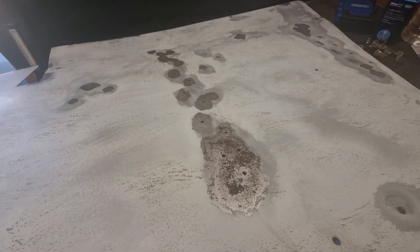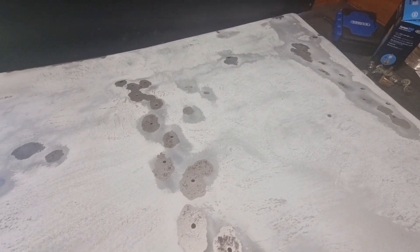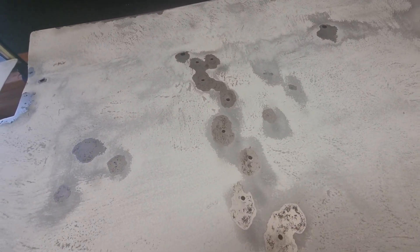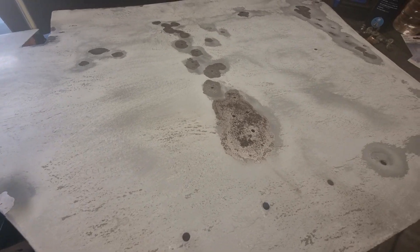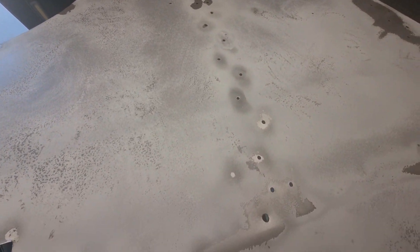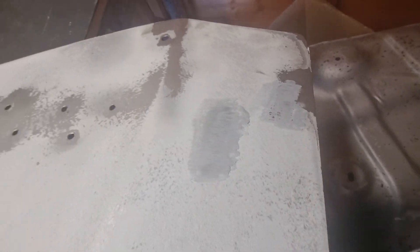I did have an idea to try and find someone local who can acid dip it to strip it right off, but I've decided to just buy another sheet of mild steel and make another one. That's probably going to be the easiest and quickest way of sorting this out, and that way I haven't got to worry about spending hours and hours trying to do this by hand. On one area I did try a flap wheel on a grinder and it just smudges it, so that idea is out of the window. Just got to wait for the other sheet to turn up so I can get it cut and drilled.